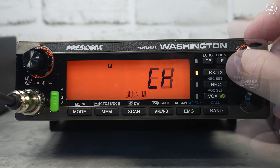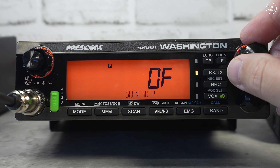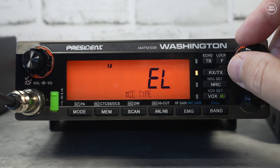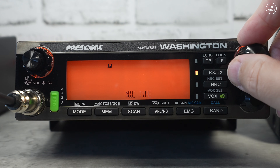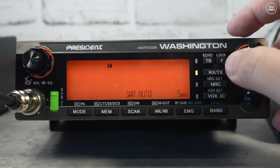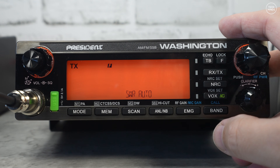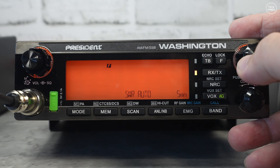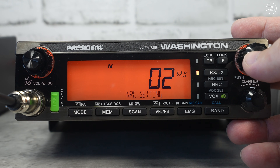You can choose to display DC voltage or temperature on screen. Then there's scan mode, scan type, and scan skip — a whole separate section I won't fully cover here. PA setting lets you adjust the public address function. Microphone type lets you choose between an electret or dynamic microphone, which is quite handy. SWR calibration emits a tone from the radio allowing you to manually adjust the aerial while transmitting, showing SWR on screen as it does so.